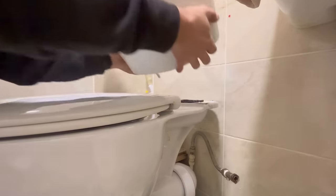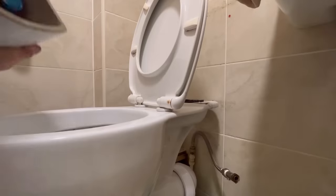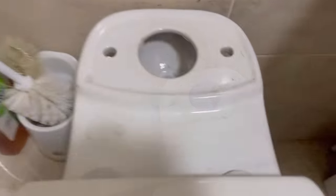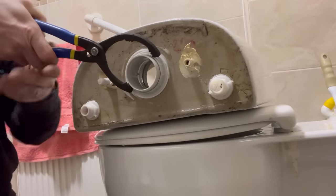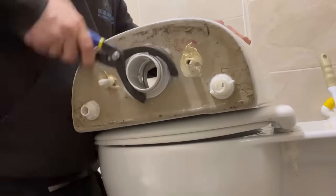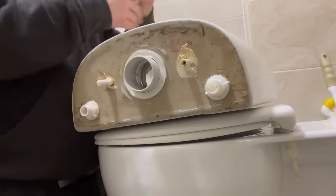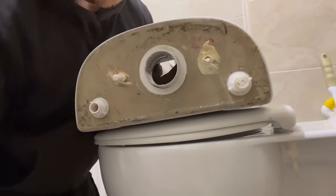At this point, as soon as it started lifting — yeah, I already knew how this had been installed: with a boatload of silicone. It is my pet hate — I absolutely hate it when I see silicone used on rubber O-rings or washers. There's no need for it. That was caked in silicone, so now I've got to scrape that off. I ended up having to get my Stanley blade in there. Then I used an oil filter wrench — I normally use that on filters, but because of the size it was perfect to get this big nut off. We undid the nut, got that out of the way, and it wouldn't budge — it was absolutely rock solid.